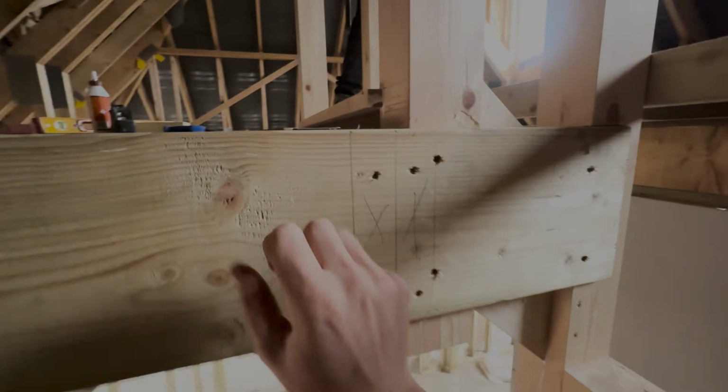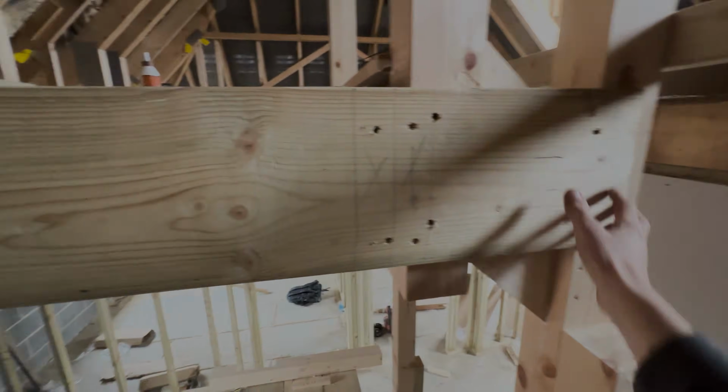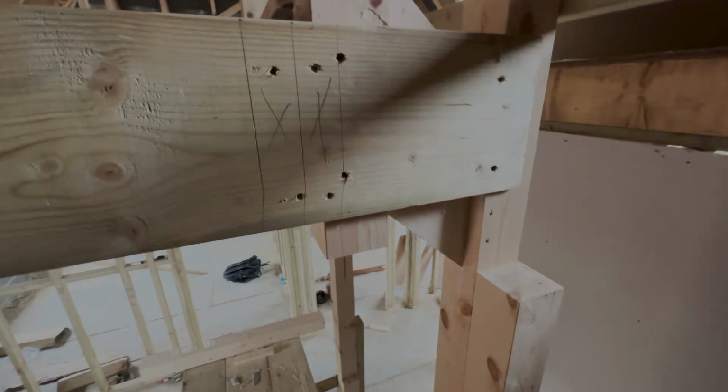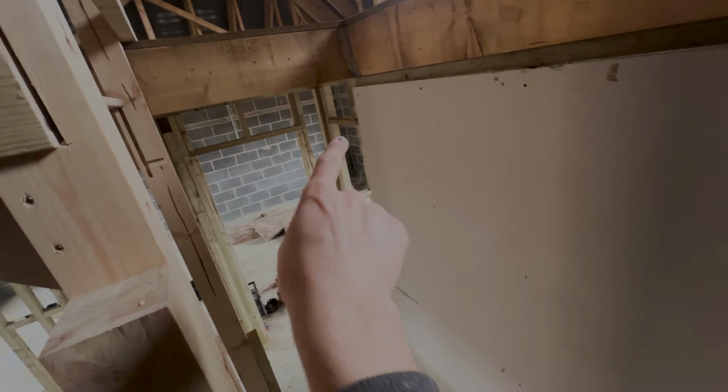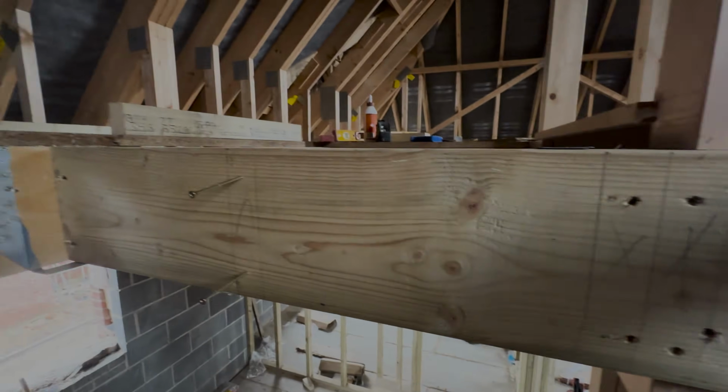Well, we've got this 8x2, 9x2 to go on first, then this other newel will go on and close that up. We'll put that in, Caberdeck the top, run that underneath, just put some packers in there for now, and then we're going to get that string in with the newel, then that string in, then there's a bottom section that's made up which will then go into it. So yeah, going to go to tea now though.